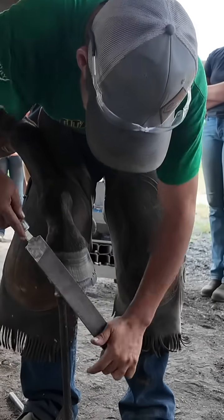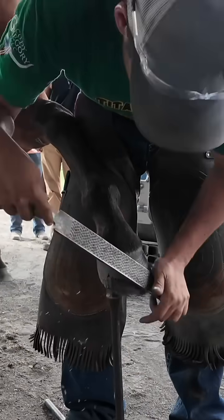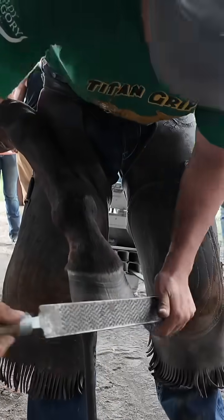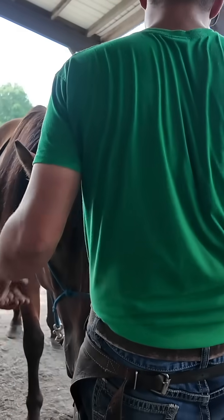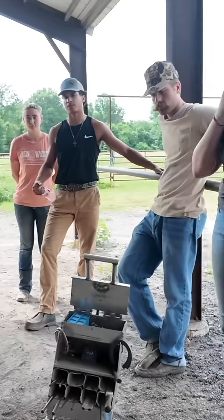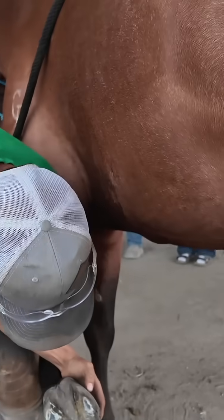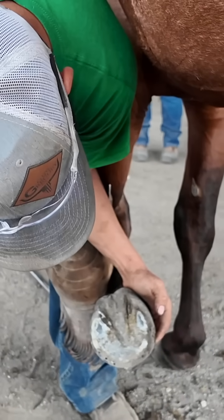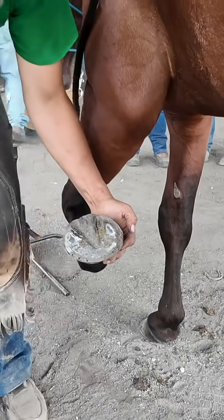I'm going to put an inch and a half into it for my swell. So that's twelve and three quarters for my shoe, and that's what I would need just for the shoe itself. I always like to start with that because then I know where to put my marks. Then I would add my bar width, which is another two and a half, so I'm at fifteen and a quarter — we'll go with a pair of sixteen and a quarters.